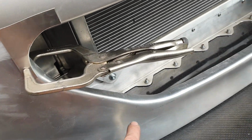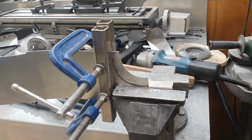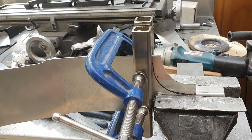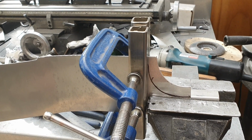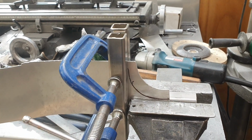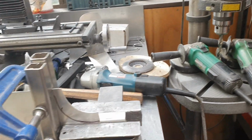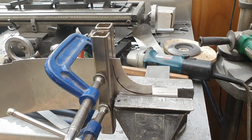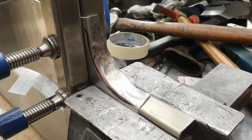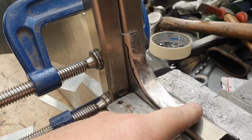However, you can do what I've done here, which was kind of, in a way, that set up there. So it's out with a hammer. See if it works or not. If it doesn't, I have to cut it. I'm going to have to weld the strip in there, and it's all going to distort, and then I have to use the old angle grinders and flappy discs and whatnot and finesse it into what we want. Piece of cake. Not the prettiest piece of aluminium on the planet, but obviously we finish it off from there.